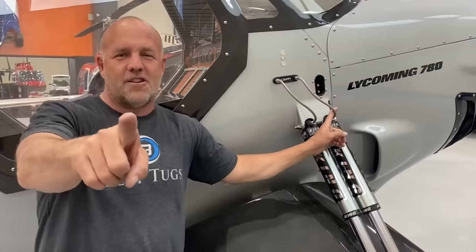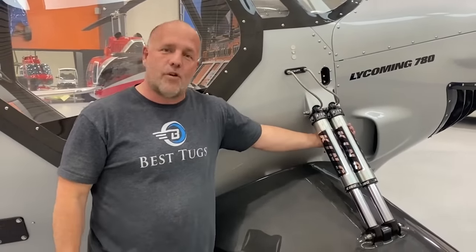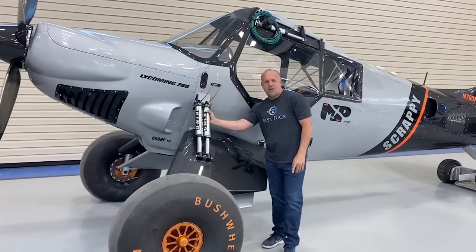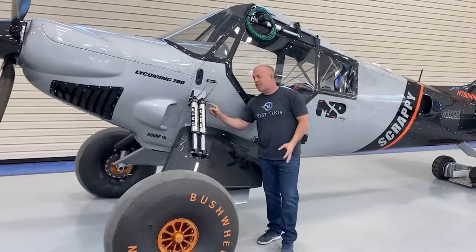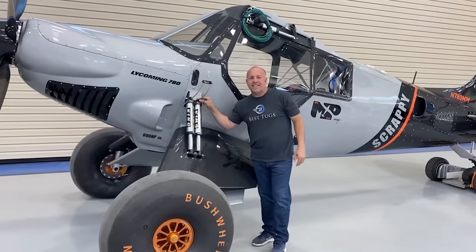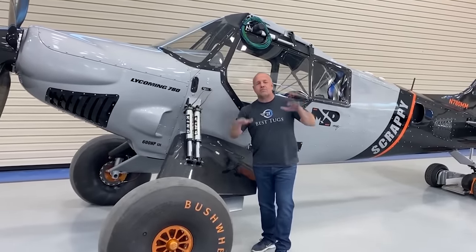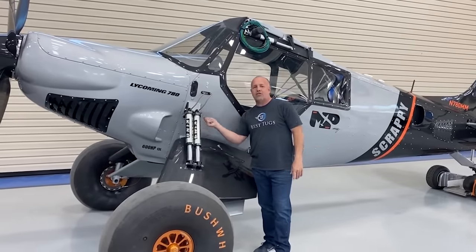King, thank you, King. You guys are awesome. They didn't have a system specifically for what I wanted. I can't have the air just do a normal system the way an air ride works on air shocks, because as air goes in, typically you just fill it up with a pressure bottle or nitrogen and then you cap it and leave it. But if I'm letting air in and out regularly to continually adjust for my terrain, I would literally push oil back through the system.